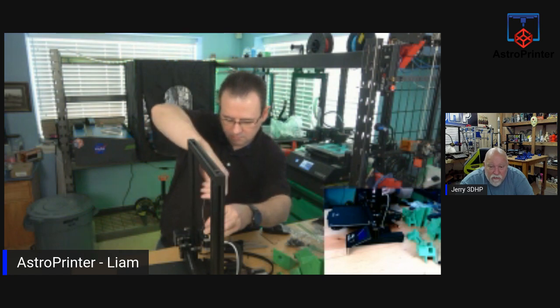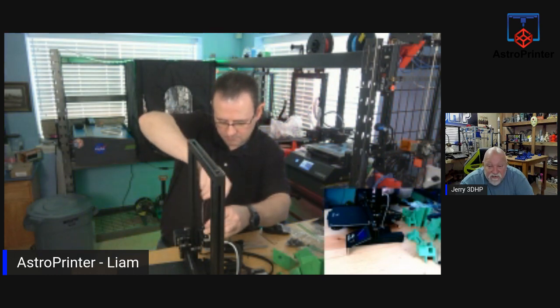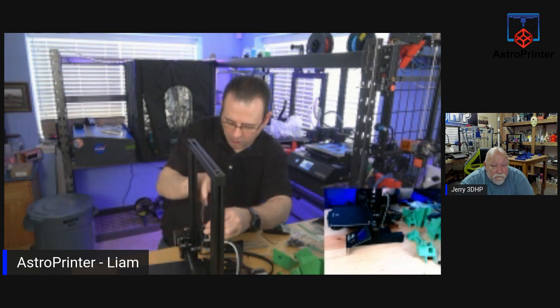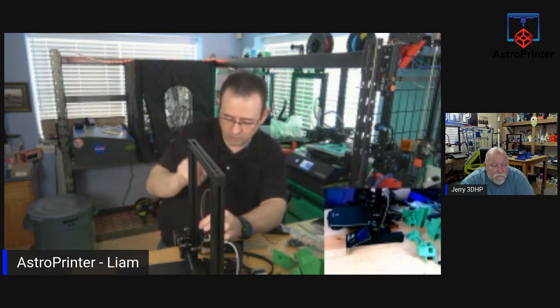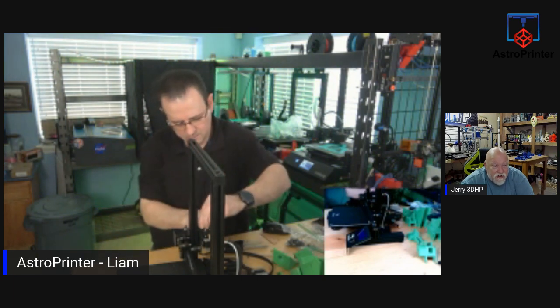Yeah, Vape Doom, if you're able to replace them with ferrules, it's best to do that. I have printers that have had tinned wires, and I've never had a problem, and they've been fine, but it's best to replace them when you see them. And Creality have a horrible habit of tinning their wires. There's other manufacturers who do it too. They're not the only ones, right? But they consistently do it. But they're starting to change. Aren't they generally the newer machines, I believe? I don't have any newer machines. Yeah, I believe they're starting to change.